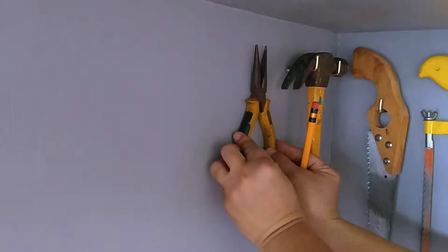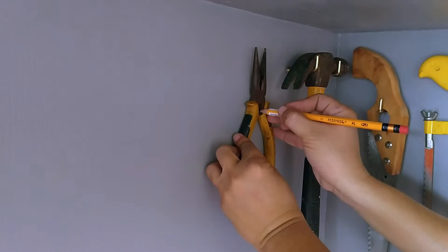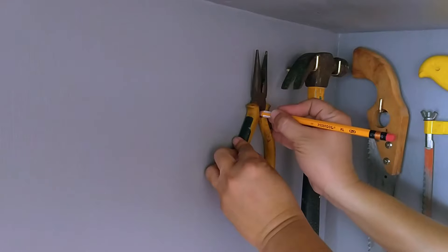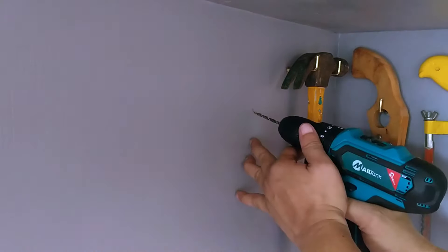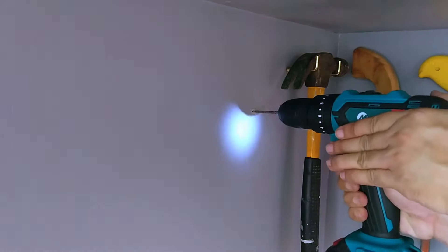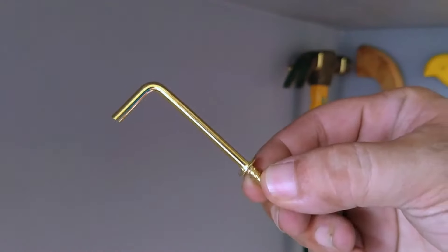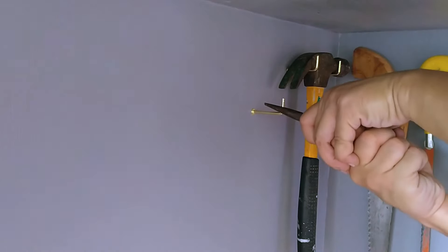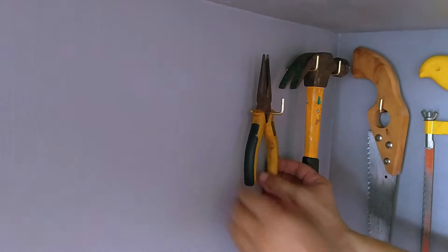Here's the basic process: I line up the top tip of a tool beside the tip of another tool, determine the center of gravity of the object, mark the spot with a pencil, drill a shallow pilot hole, screw in an L-hook — also known as a square-cup hook — through the pilot hole, tighten with a pair of pliers, and finally hang the tool.